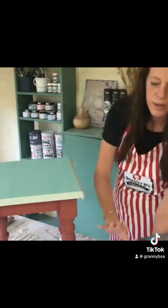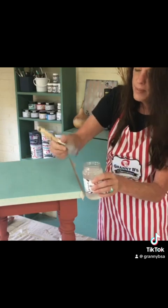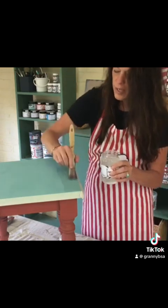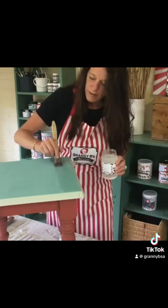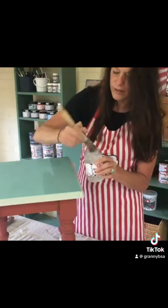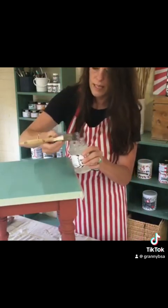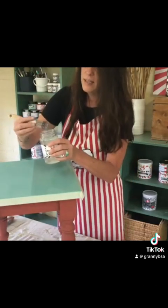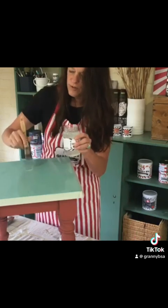We're also going to talk about different crackle effects. For nice thick cracks, apply the crackle medium nice and thick. If you want smaller, thinner cracks — more like porcelain — you do not need to apply it as thick; apply it a little bit thinner. I'm being generous with this and covering the entire table with the crackle medium. It is very gooey and drippy, so that's to be expected. I find that synthetic brushes work extremely well for this — they smooth the medium over the surface really nicely and evenly.